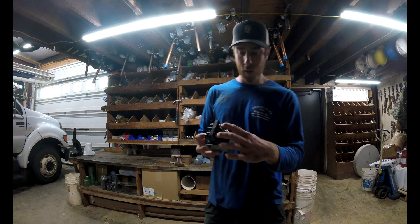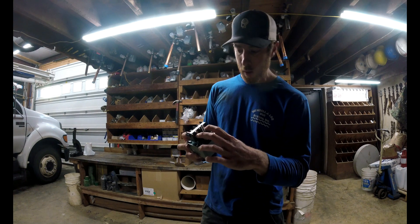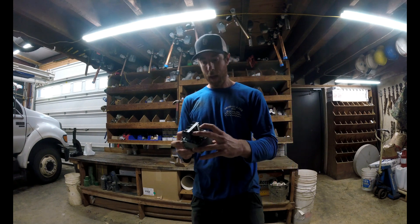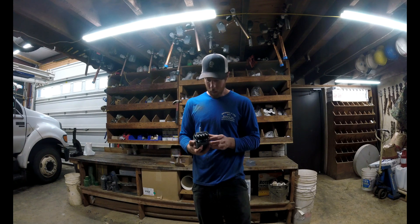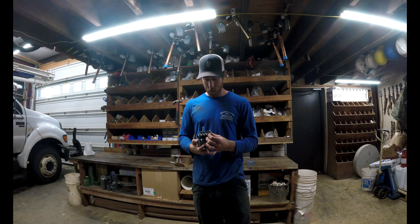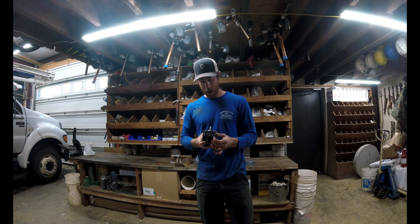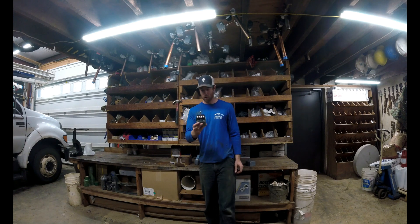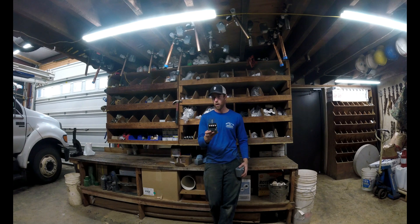The contact points — you can see them in there — are a whole lot more heavy duty. These are able to handle about 20 amps versus the standard switch, which is able to handle about 12 amps. You've also got bigger holes and screws here, so you can not only get bigger wire in there but have a little bit easier access to it as well.